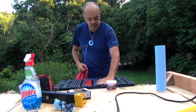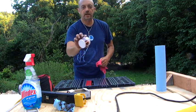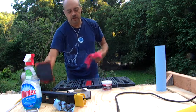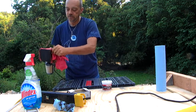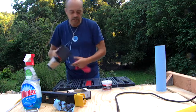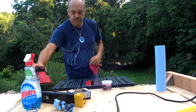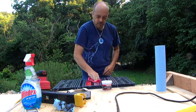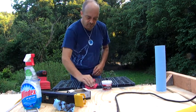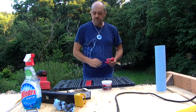And there you have it. Just to recap, all I did is I took some of the Mother's Mag and Aluminum Polish and put a thin film on top of the aluminum. Take a piece of a rag and attach it to the palm sander, and then just let it glide over top and let it do the scrubbing action on the surface. I don't even think I spent an hour on it. I got just some goop and screw holes and stuff to clean out, but that saved me a ton of labor.